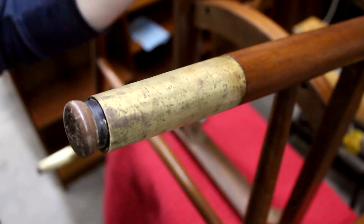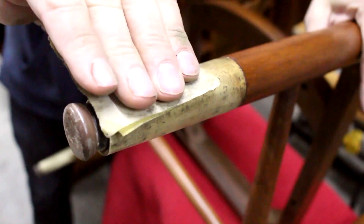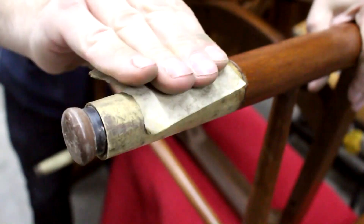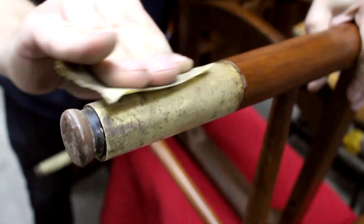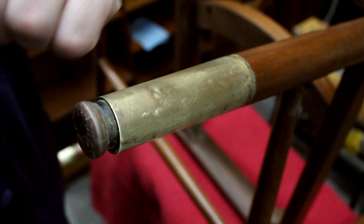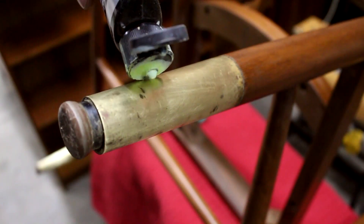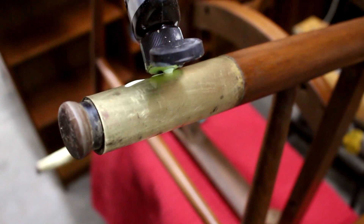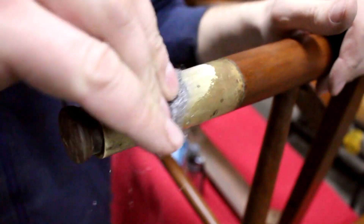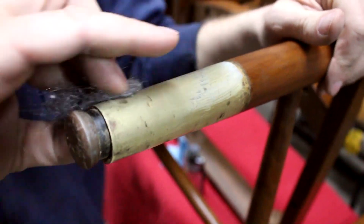The finishing touch was to clean up the brass slippers at the bottom of the legs. I used some really old, well-used 320-grit sandpaper — probably 400-grit would work also — to get off most of the dirt and marks. Then I used Flitz metal polish and some 4-0 steel wool to polish it up a bit, and it came out nice.